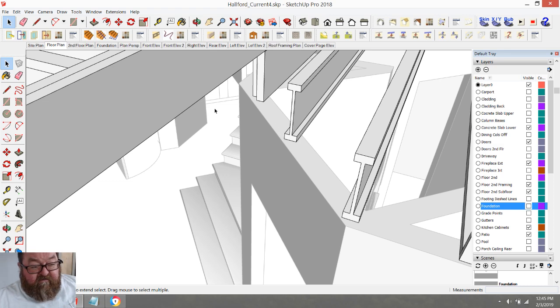And then you'll put notes on it saying 11 and 7/8 wood I-joist, and you'll point to your band, you'll point to your girders, you'll point to your fireplace opening, and I'll have probably some lines indicating the outline of the house or whatever. And yeah, that'll be that. And then because you won't actually show the subfloor, that's why I have it in a separate layer. On this drawing, you just want to show how the joists work out, or how you're suggesting that they work out. And that will be all.